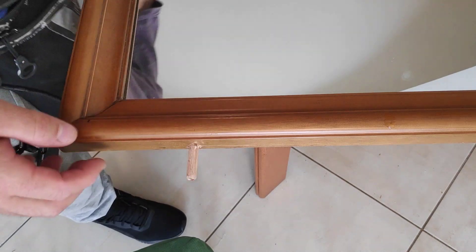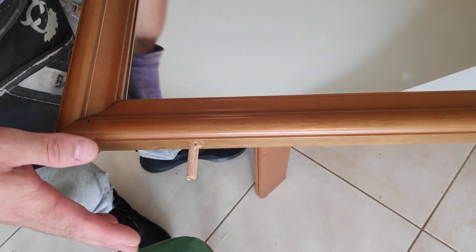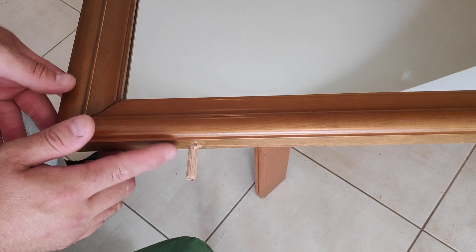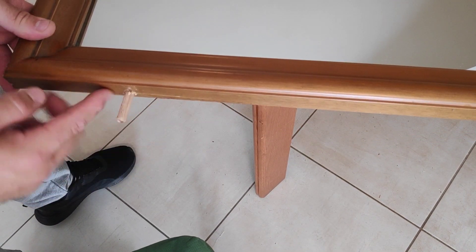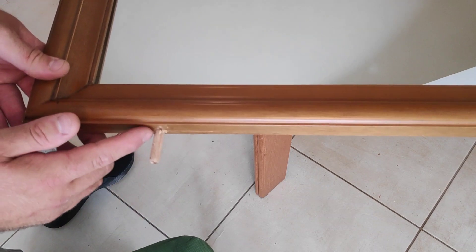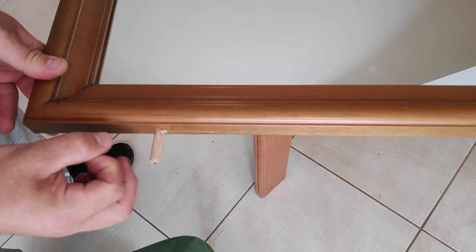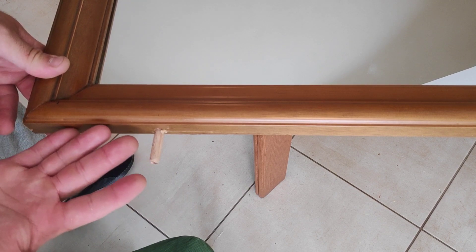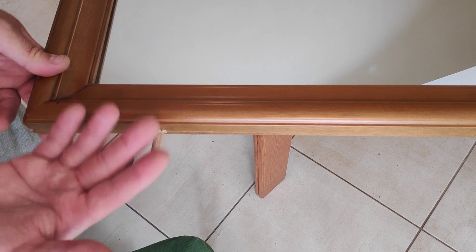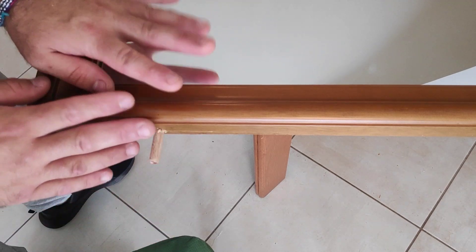Welcome back to Unboxo. This is the frame that we started working on just yesterday. I had two holes on this side which were filled up with hinges, and I had to take off the hinges. Now I filled them up with some simple dowels. I'm going to cut these dowels flush right now and then show you what the progress is on this project.